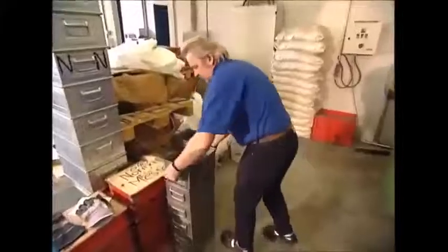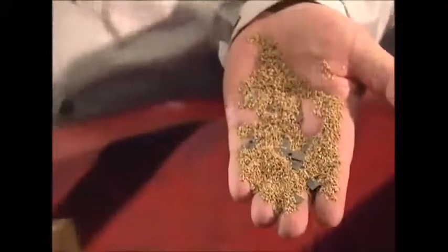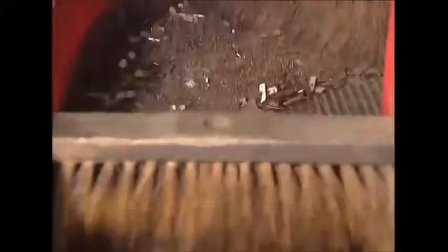This time they're not washed. Instead, the blades are immersed in sand which absorbs the oil. This is a rather messy process, and the workers end up with a giant drum full of oil, sand and blades. To clean this off, they're passed through sets of brush heads and over big sieves, leaving clean, hard steel.